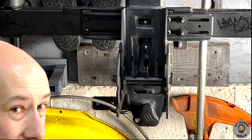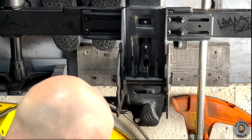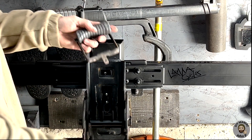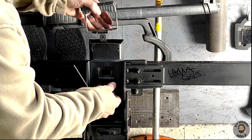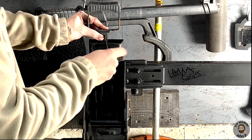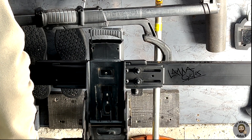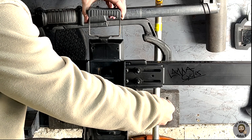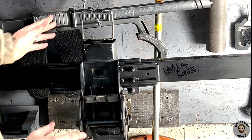Here is the linkage bracket that holds that sliding lock bar - we're going to put that into place and let it sit right there on the pivot joint. Our linkage that we cut to length we can insert from the top down. Make sure the threaded bolt end is facing the handle and the part where you tighten it is coming outwards. You'll want a longer rivet that fits through the hole ready in your rivet gun. Line up the holes and put your rivet in place. With the first rivet in place, go ahead and put that second rivet in. With the linkage riveted in place, we can now put the handle back on.